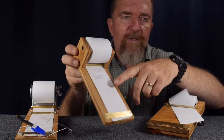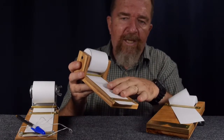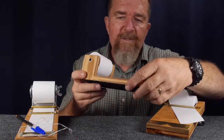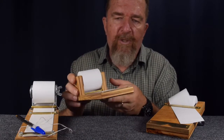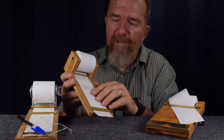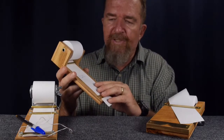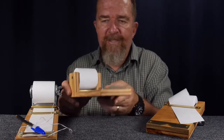And yes, we need cheddar cheese — that's my wife's note. This is my wife's notepad holder in the kitchen. It has the brass strip with a little spacer underneath so the paper can slide nicely, and I have adhesive craft felt on the bottom. It probably would have been better with adhesive craft foam or some kind of rubber material, because on a hard countertop that felt does slip a little bit. The only downside I see to this design is that the oak plywood is a slightly uneven surface because of the grain, and if you press really hard with a ballpoint you can gouge the wood. But it has a nice, clean, modern design. I really like it. That's the second one.